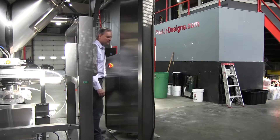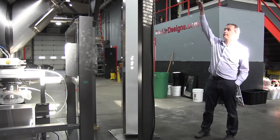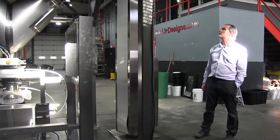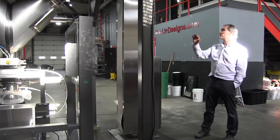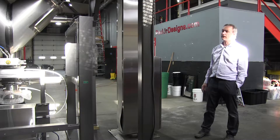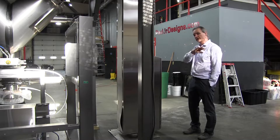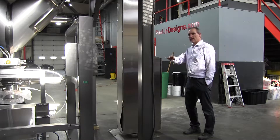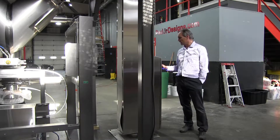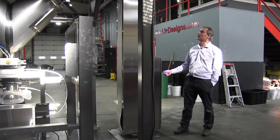We're going to slew over to the discharge position. It'll automatically lower very accurately. It slows down and ramps — the slowing and ramping is how you attain very fast speeds with accurate positioning. When it gets close to its discharge position, it'll run a motion profile and stop very accurately.